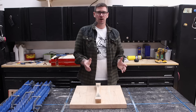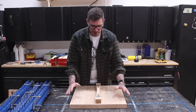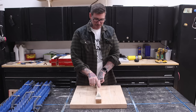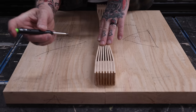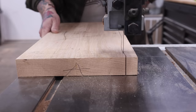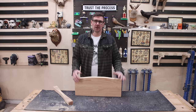The next thing I need to do is figure out how to put this piece in the middle of the seat pan. Trying to scribe this in accurately is not going to be easy. I'll line it up right in the middle, trace the outline, take it to the bandsaw to make that cut, then temporarily CA-glue each side, route that exact edge, and then glue the whole thing back up and cut out the seat pan. If you listened to everything I just explained about how to cut the curve and glue up this piece, please immediately forget it — that is very much not how this works.